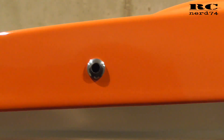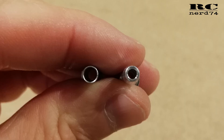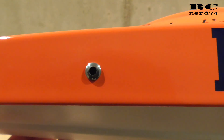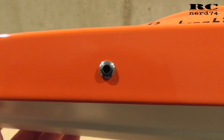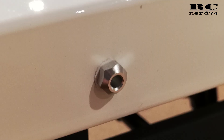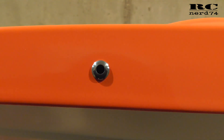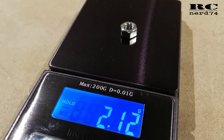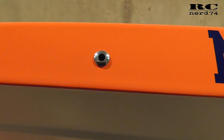Almost the same thing I did for the water outlet. The part I ordered from AliExpress had one big problem — the inner diameter was thinner than the original: the original part has 3mm inner diameter and the AliExpress part only 2mm, so I wasn't able to push the same amount of water through the cooling system. I decided to modify the stock part instead to make it look nice and fit better. As you can see it's also a thin shape now, surface polished, and it looks even nicer. I also changed the heavy steel nut to an aluminum nut which makes the part way lighter and it looks way better.